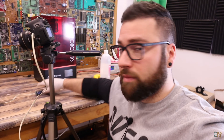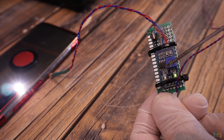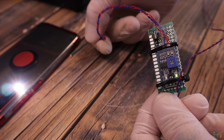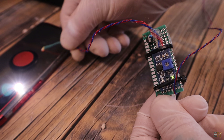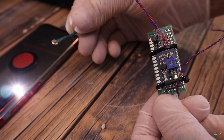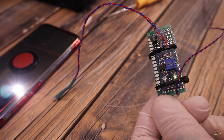The only issue is that this output from the camera can provide 5 volts due to a pull-up resistor — actually 3.8 volts because that's the voltage of my camera. A pull-up resistor limits the current, so this module will be supplied with an external power supply at 3.3 or 3.8 volts. Let me show you an example — this LED shows the output state. I'll simulate the light with my phone's flashlight: each time I place the LDR in front of the light that LED turns on, then off, then on, then off.